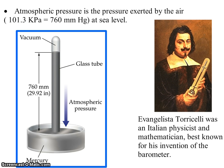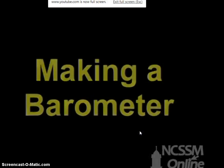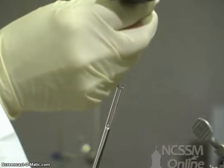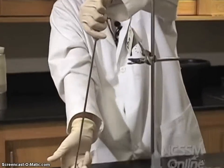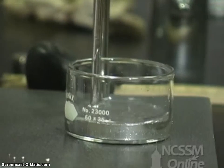I'm going to show you a YouTube video of one that's actually created. We're going to make a barometer. What I have here is a glass tube that's about 800 millimeters long, and I've filled it with mercury almost to the top. Now I'm going to finish filling it all the way to the very top, then put my finger over the end and invert it into the mercury. I'm going to set it here and use a clamp to hold it.